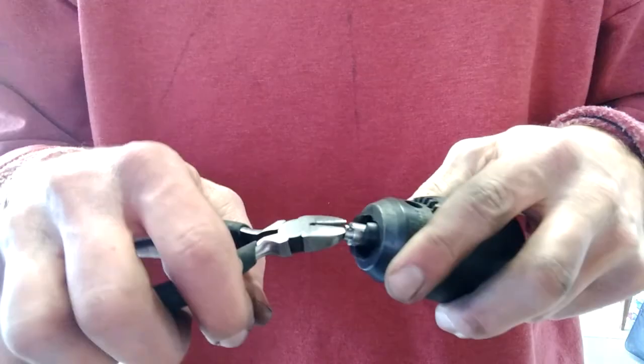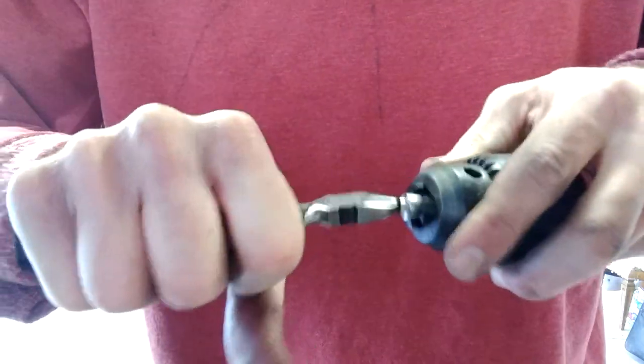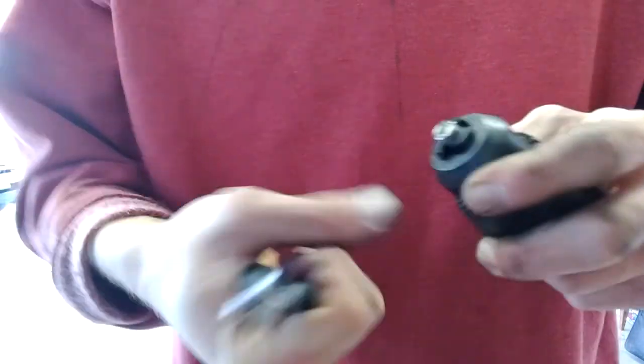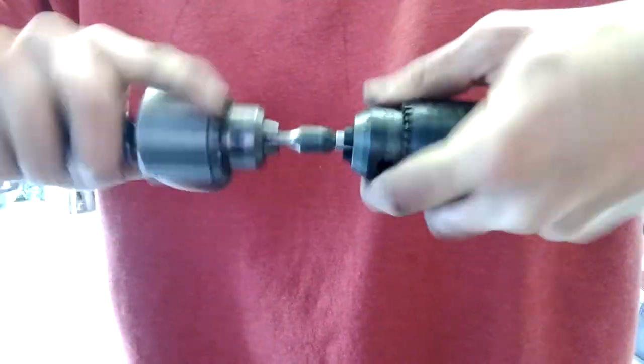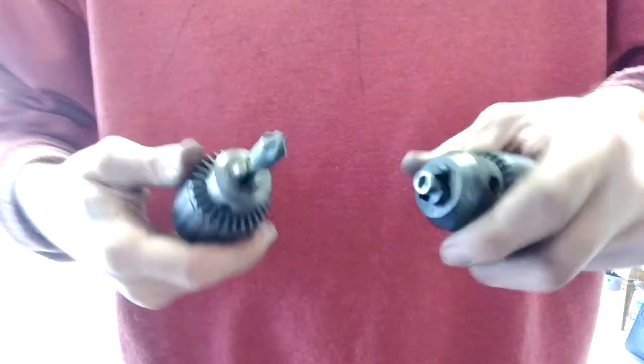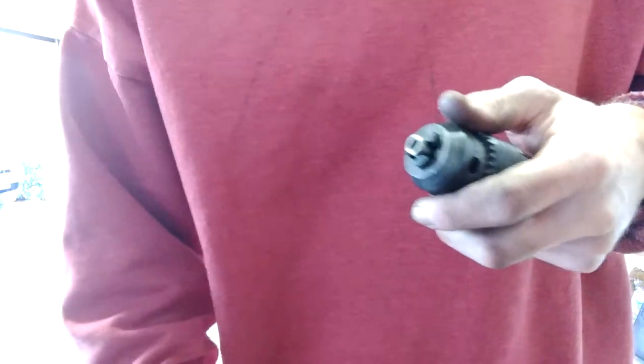So I was wondering how am I going to deburr all these, it's going to be a nightmare. So I figured, clamp it in a chuck, use the dykes to get this burr off, like that, then come in with a chamfer tool. And I already filed them in the lathe, so that's already smooth. So that's saving a lot of time.